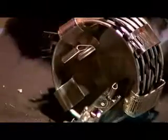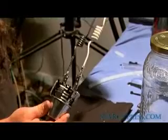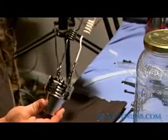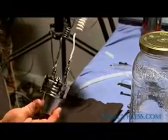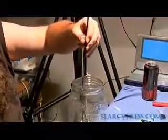Okay. You're going to have to make some adjustments in order to get the alligator clips to properly connect the stainless steel connections. When you get a firm connection from the alligator clips, you should be able to survive a drop test. Now, you don't want this thing actually banging the bottom of the glass jar. However, you can let it rest against the jar during operation. That's fine. You just don't want it banging back and forth. The springs that you see are actually inductors, and they're also a safety device, which I'll demonstrate near the end of the video.